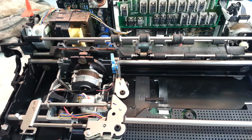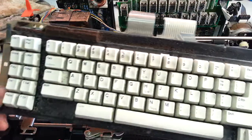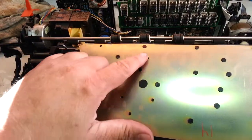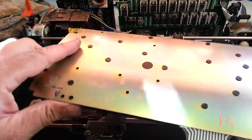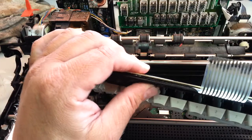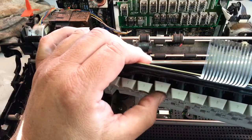We've got ourselves an IBM Wheelwriter 5 that we had to order a new keyboard for. It's separated. So the old keyboard — you can find it here. All these plugs here that hold it together are missing and the keyboard is separated. As you can see, it squeezes together and that doesn't allow these switches to work.